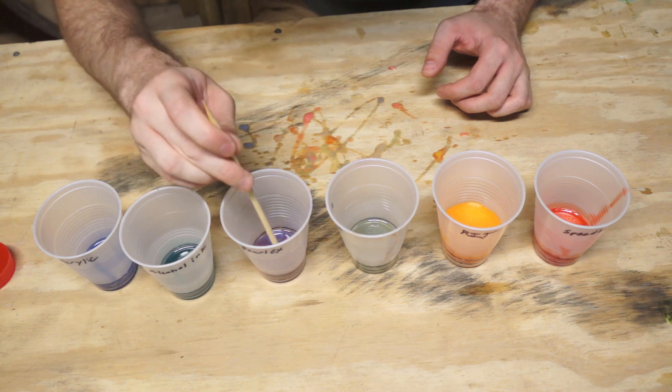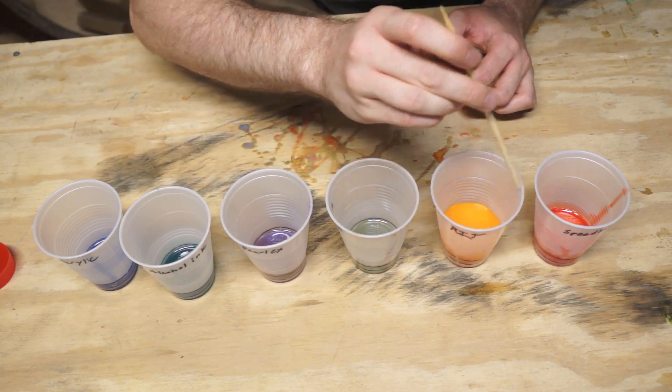Right away I noticed there was something going on with the liquid fabric dye, which means this is not going to be boring. First I gave each sample a quick prod to see if any of the resin was still tacky. Cure inhibition was the issue I was most worried about, and it looks like in each case the resin did set up, which is great. Each one of these samples has a little bit of uncured resin on the sides and the bottom — that is not a result of the colorants. Normally when mixing a two-part chemical like an epoxy or resin, you want to scrape the sides of the cup and pour it into something else, because the sides and bottom tend to get a thin film of either part A or B that won't integrate properly. That's especially true when mixing seven batches two-handed in under two minutes, and that's exactly what happened here. So the sticky edges you'll see are a result of bad mixing, not of any of the different colorants.